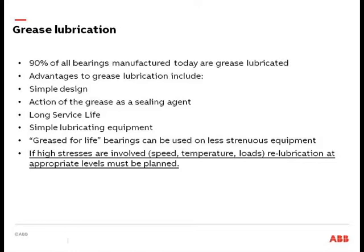Auto-lubbers — battery-powered automatic lubrication greasers — are a great option. If you can dial those in, especially for bearings at the top of a grain elevator a couple hundred feet in the air, it's a much better option than sending someone up there in February. With grease bearings, things that affect re-lubrication intervals include speed, temperature, loads, and contamination. Grease-for-life or no-lube bearings from us as a manufacturer are essentially the same as a re-greasable bearing but with a set screw plug in the grease zerk hole instead of a zerk.